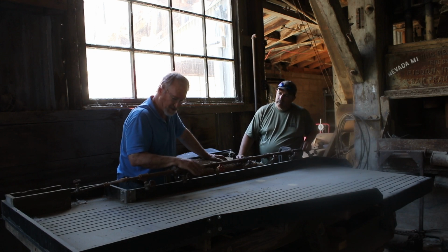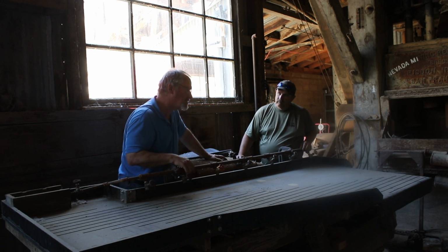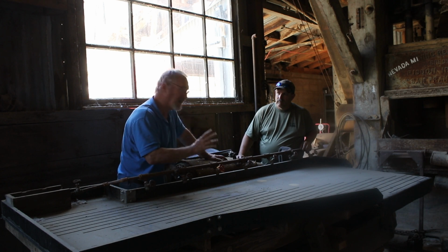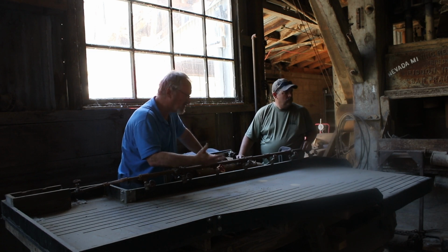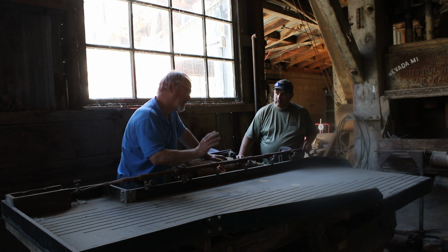But usually the product that comes off of this is really clean, especially the number 1s, and requires some, but not a lot of cleaning up to be ready to pour it into a bar. And so there's a lot of smaller scale mining operations that have some sort of crushing, like a jaw crusher, and then some sort of secondary crushing, the equivalent of the stamp mills that we were looking at, that would crush from, you know, like -1.5 inches or something like that, down to like sand size, like 20 mesh, something like that, 30 mesh. And then you treat it with something like this, and the tails that you get, if